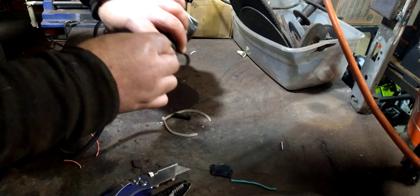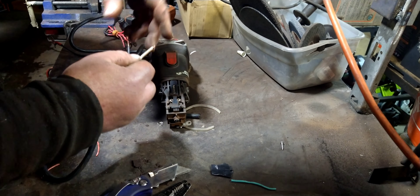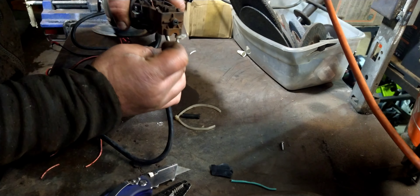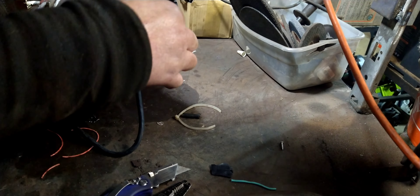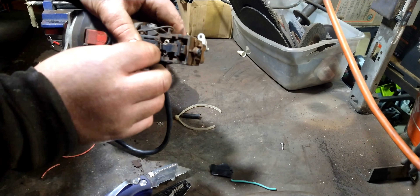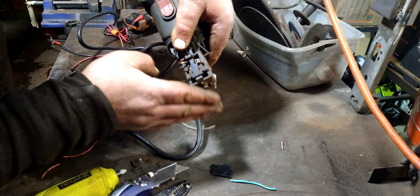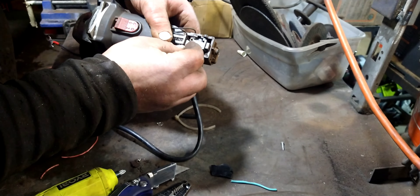So I'm just going to get rid of this one and here's my new cord. I'm going to snap that ground prong off and snip this ground wire. I've got to strip this a little more. This is really hard PVC insulation. I wish I had some SJ cord — that's what they call it, power cord with a rubber insulation on it. Makes it a lot easier to work with, might be silicone rubber. But this is cheap, cheap power cord right here, even this replacement one I have, with really stiff hard PVC insulation on the outer jacket.